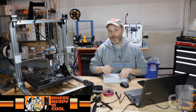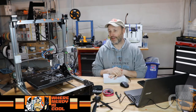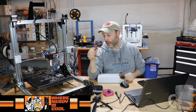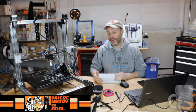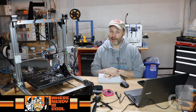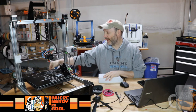So in the last video, I think it was Caleb and others had suggested, hey, you should take a caliper and come up with a mount, because John Folger sent me an improved power supply. He sent me some Kapton tape so we can get this bed wired up and take care of that next. But he did send me the FT-i3 switch, and I searched high and low for a 250-volt, 4-amp fuse, and those are hard to find. I could find 3, and I could find 5. So I was finally able to find a 4-amp fuse, and that has now been installed and placed into that switch, which I have rigged up here in the back right now.